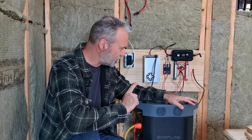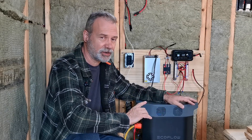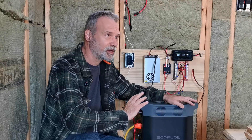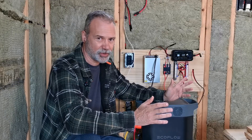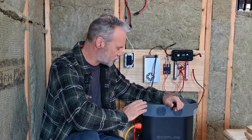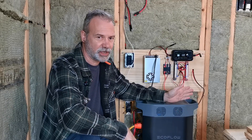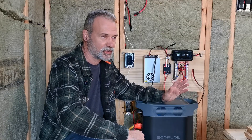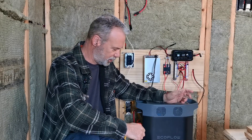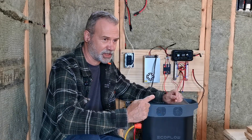So usually though, if I'm running a diesel heater and the lights, when they're running, I'm at like 50 to 60 watts - and that's what my power usage is. So the lighter plug can handle that. The lighter plug can also handle starting the diesel heater if there's no other load on that 12-volt system. So that's the caveat: if I'm going to run 12 volts out of here to run everything, I can start the heater as long as I shut off all the lights.